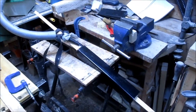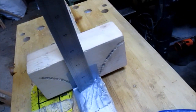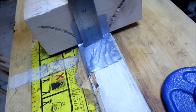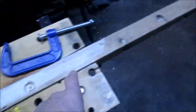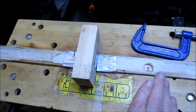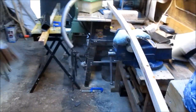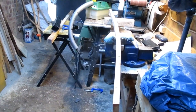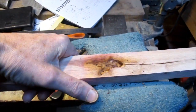Once it's had a good old steam, I'll pull it out of the tube and bend it over a block of wood — just over two and a half inches. I'll put the middle of it on there, clamp down either end onto this straight bit of two-by-two with a pair of G-clamps. That should give it a nice bit of deflex in the middle; of course some of that will bend out. I've now done my gentle steam bend on this chunky yew stave.